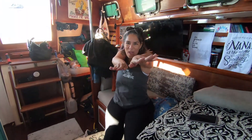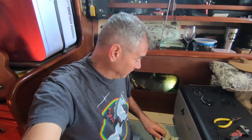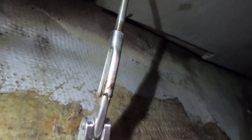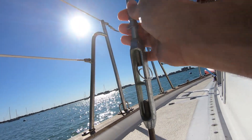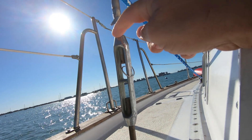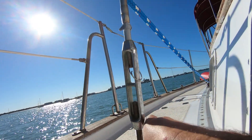So guess what we got? Ta-da! So we're going to be replacing this today, and we're going to be replacing that — that Maddie found when she was doing our inspection when we were leaving. Now the rod. How I'm going to do this: I'm first going to be taking this turnbuckle here. I marked it so I know where to adjust it back to, since our rigging is actually properly adjusted. And then take this ring off.